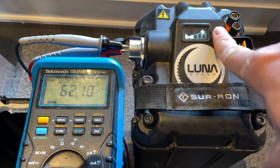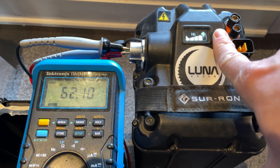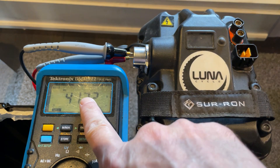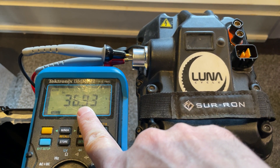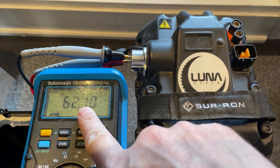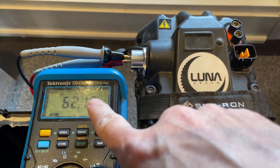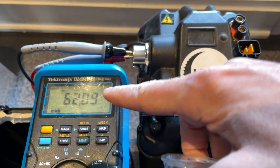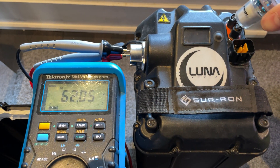All you need to do is reset the battery — press and hold the button for 10 seconds, then release once you see the voltage dropping like this. That means the BMS is resetting. Now it's back to sleep, so all you need to do is take your LED, watch the voltmeter, and plug it in like this.